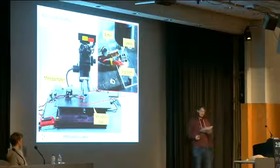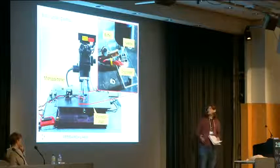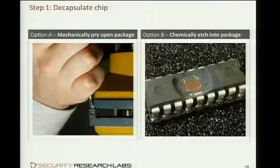Yeah. In this case, the chip's already opened. Opening chips is not that easy, but it's doable, even for a hobbyist. On the left thing, it's quite funny. I opened it with a screwdriver. Here's the mouse. Here's the chip, and here's the screwdriver. I opened it by prying it. You just apply the screwdriver on the joint where the ceramic package is. It's joined together. It has a top and a bottom part, and you knock it softly with the screwdriver, and the package top is flipping off.